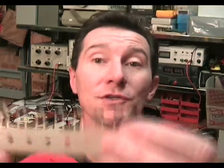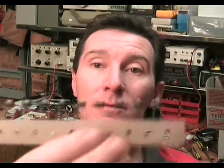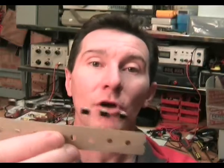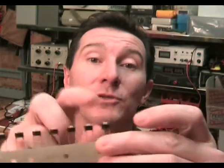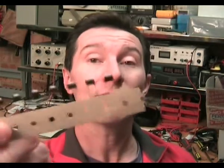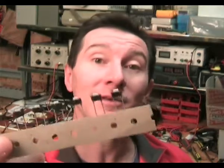So I decided to go to through-hole switches, and I got these little tact switches, which are really cool. They've got a nice 6mm by 3.5mm profile, and a nice soft tactile click that you can press with your finger. Really, there were only one or two choices on the market when it came down to it. You go to the catalogue — Digi-Key or something — and there are 10,000 tact switches to choose from. But in the end, you whittle down your design criteria, and there's really only one or two practical choices.